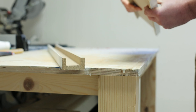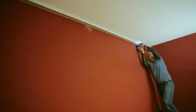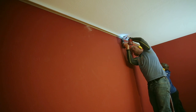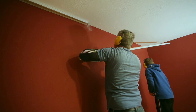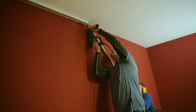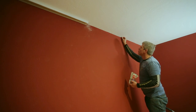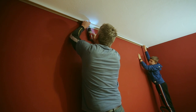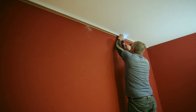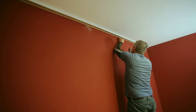I start with the outside trim channels first. I mark the ceiling for the exact location of the pre-drilled holes in the trim, then remove the trim to drill and insert the anchors. Once that's done, the trim piece goes back up and I screw it into place, hoping I drilled the holes accurately. With enough practice by now, they all come out perfect.